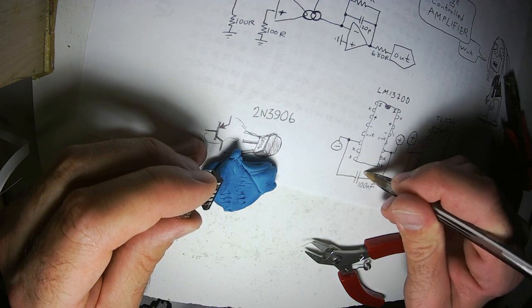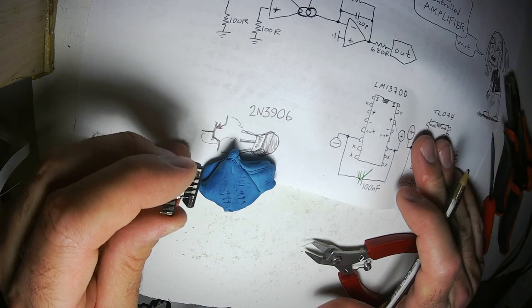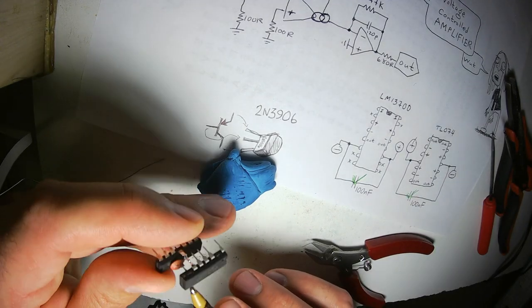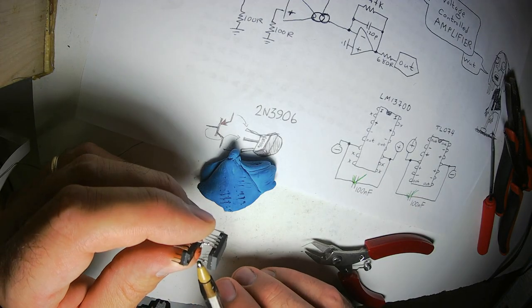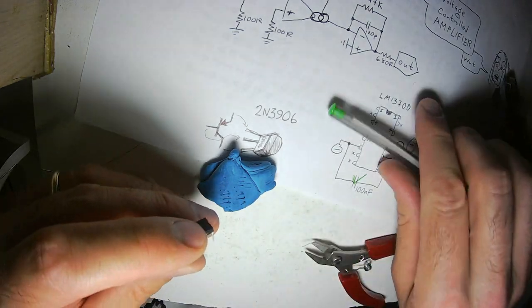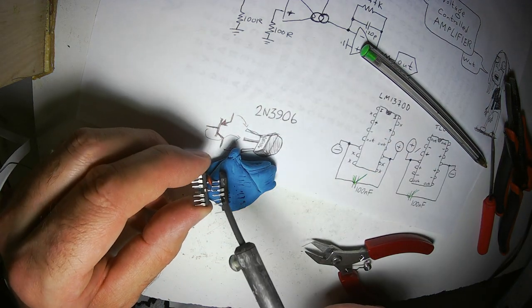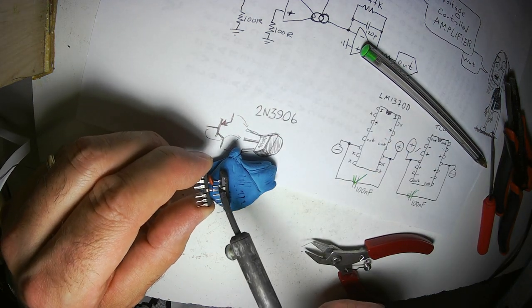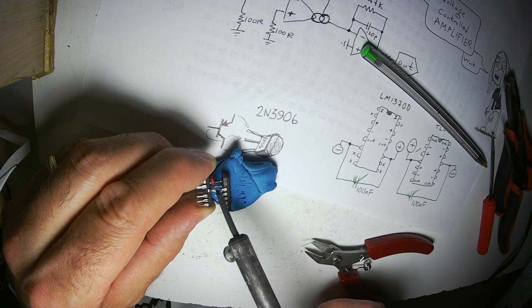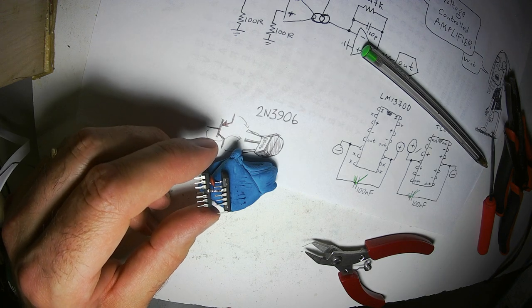Check this. That part is now added to our circuit. I'm going to do the other one too, because if you have one 100 nanofarad capacitor that close to both chips, that's good enough. I'll tell you a secret, some circuit builders don't even use bypassing capacitors. Even though some people can get away without using them, it is important because